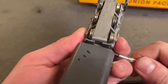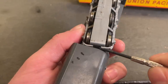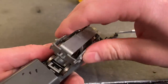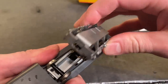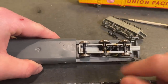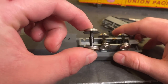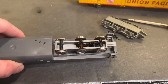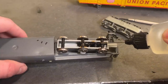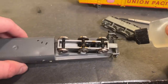We're now going to open this thing up and just lubricate the drive. It should be pretty simple — just get a flathead under this clip right here, and slide the cover forward and move it inside. You always want to check to make sure everything is really clean, as bits of hair and things like that can get wound around the wheels, but this one's looking really good, so I think I'm just going to put some oil in it. Just a bit of basic maintenance to keep this all running smooth, or at least as smooth as it can be.